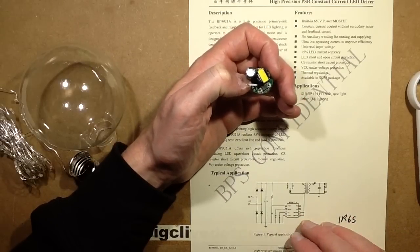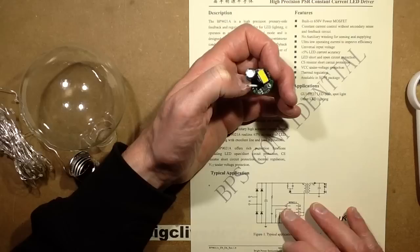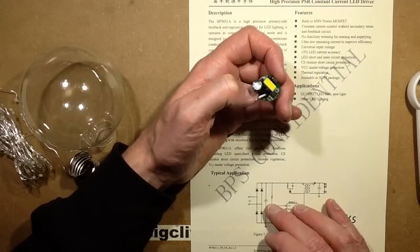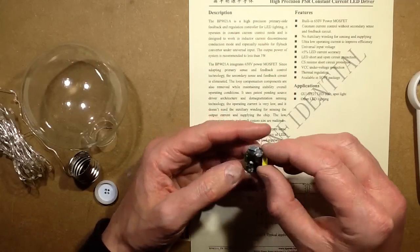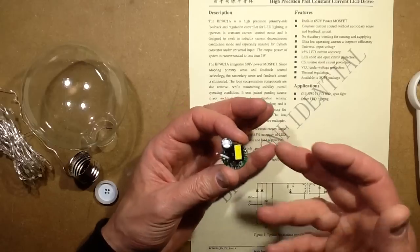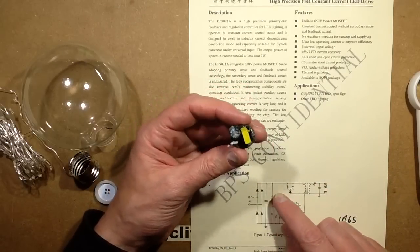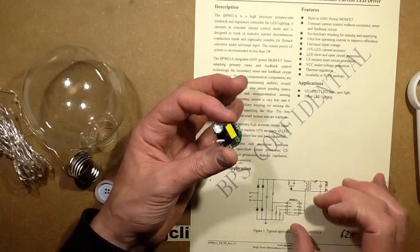And I don't know if it then derives power by diverting some of the switching current to its own capacitor, or if it's just purely powering from the resistor, which is approximately 750k I measured, though I don't know if that was being affected by other components. That resistor, certainly, provides power to the chip and charges up that capacitor, that's its power supply.